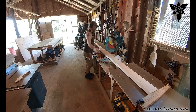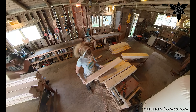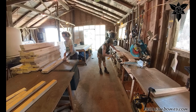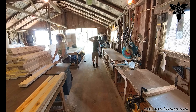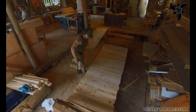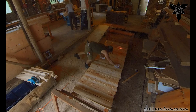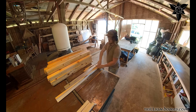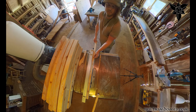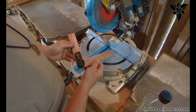The first thing we're doing is cutting everything to rough length. These 2x6s will end up being ripped into four struts. I do that instead of buying 2x2s at the lumber yard because they end up being way too warped. When I build greenhouse frames, I like to use a deck sealer — you can see me spraying it on right here and rubbing it in with rags. Now that all my exposed edges are finished, I can rip everything to its final dimension.